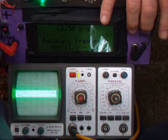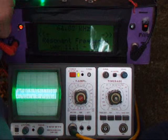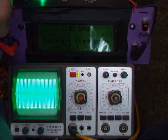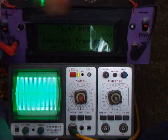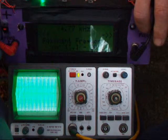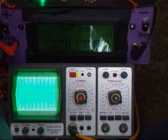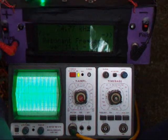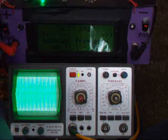Back down to 61. Let's measure that peak. Now we want to see if it increases — it does, and again, now it's gone down. So the peak is there at 74.77, which with a line for streamer loading on the secondary — which is 80 — is just about right.